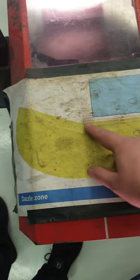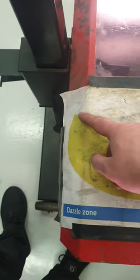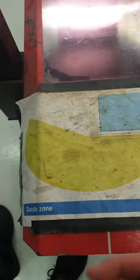The pitch needs to start at a set point and work its way up. On this headlight, it may be a bit difficult to see, but we're just slightly low at 0.5%. The pitch is sitting perfect — you can see the C-shape here, sorry about the blurriness. The pitch needs to start there and work its way up just to the C shape.